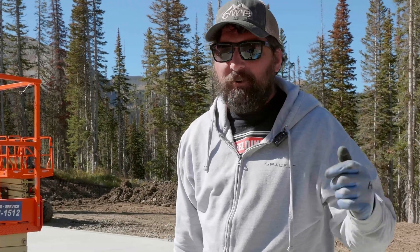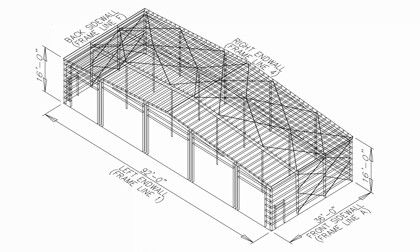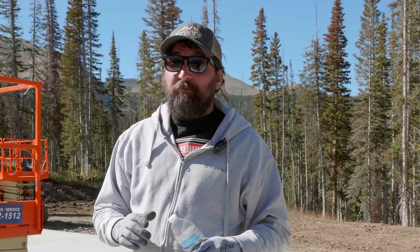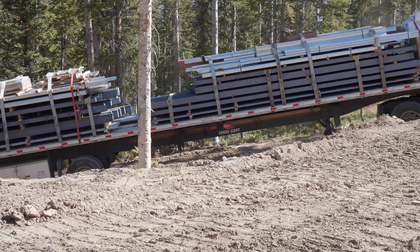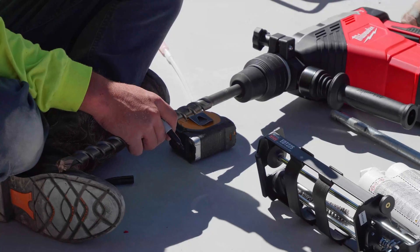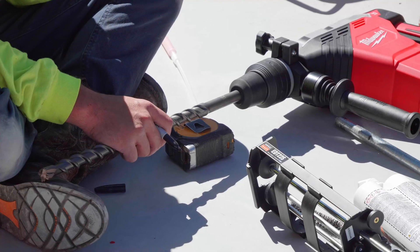What we have here — we're at about 10,500 feet elevation. We have a 92 by 36 foot building, a 1 on 12 slope, with a 250 pound snow load. So there are going to be columns, rafters, and purlins all over this thing just to support that snow load. We're drilling and epoxying eight sets of bolts, so we're going to show you how we lay that out.